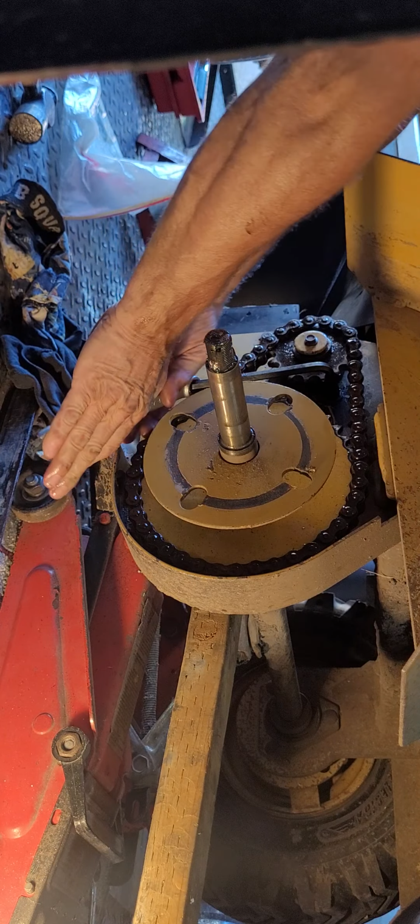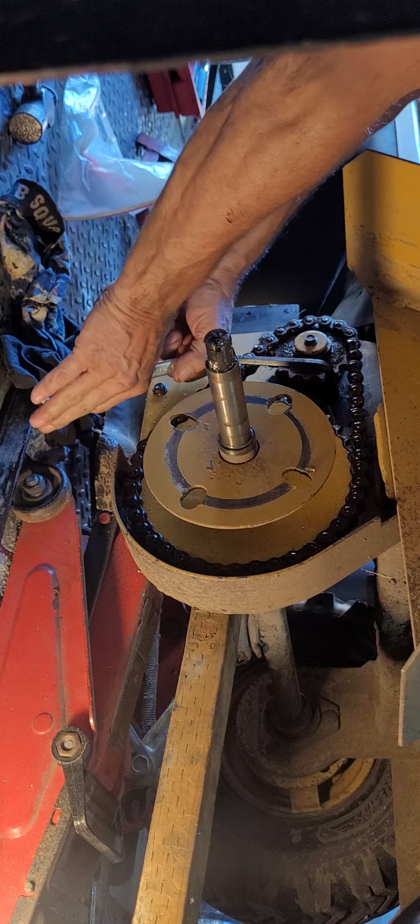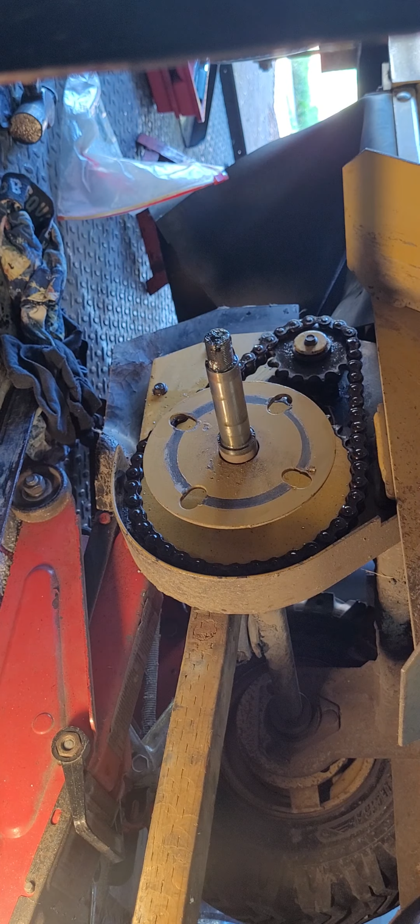Okay. Anyway. Get a little bit of leverage there. Okay, that's it. Again, don't forget to go back and tighten that lock bolt and nut, okay? Push the 3/8 on the square pin as you're pushing the motor, but it's not going to move anymore, and then tighten that 9/16 lock nut. Okay, just a second.